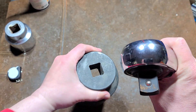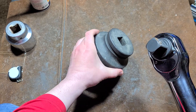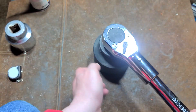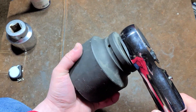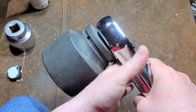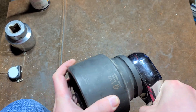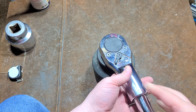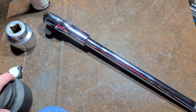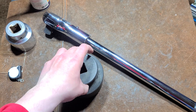We have a Sunex three-and-a-half-inch impact socket here, which is definitely a pretty stout, heavy socket. I can shake that around quite a bit and even this big old three-and-a-half-inch socket isn't just going to fall off. Around four-and-a-half inches is about the largest size the inch drive goes to — then you step up to one-and-a-half-inch drive.